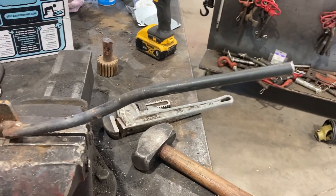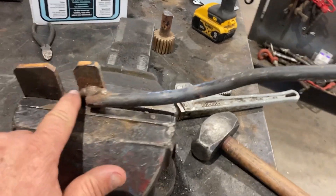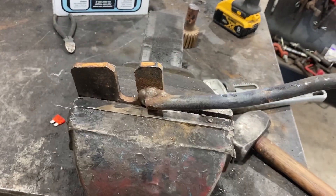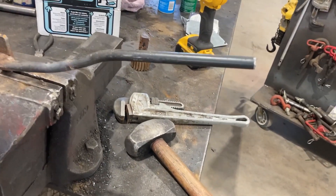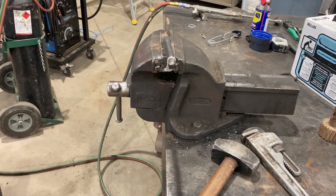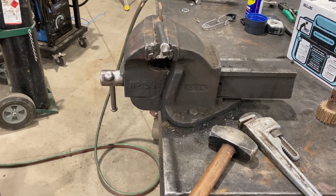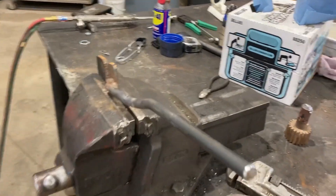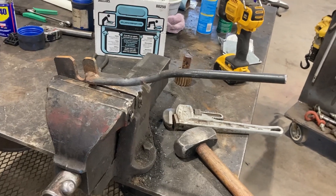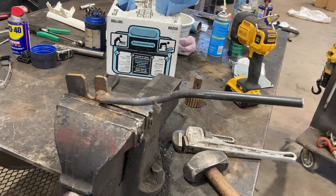This is the piece — the rod runs all the way to the outside of the bin to put it in gear. That gear loop goes right in here to engage the transmission. This thing was bent pretty bad — had a pretty bad twist in it. I've twisted it straight somewhat and I'm going to take it over and see how it lines up. From what I'm seeing, this looks like it was the culprit.